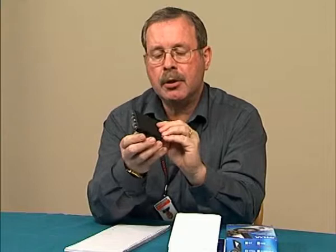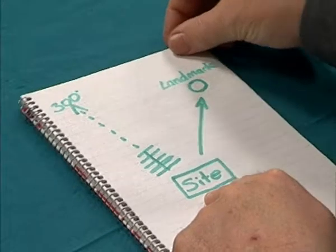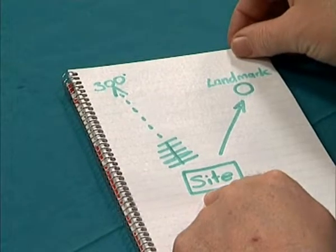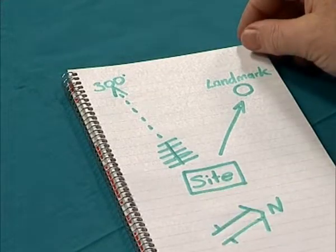If however the compass needle is totally erratic wherever you are, you can't really rely upon the compass. So you should take a map of the local area — your site is here — look at a landmark and physically align the map with that known landmark. Then the antenna direction can be read from the map. We can align the antennas without the use of a compass.